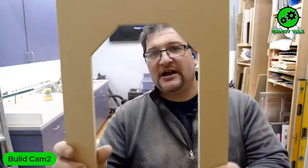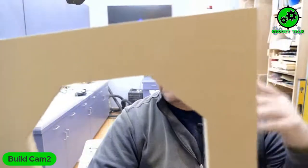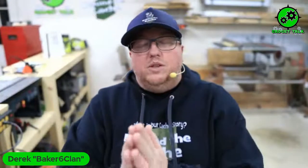So anyways, you can see the corners. They turned out pretty good. They're pretty cornered. You know, there's a roundness to them. No matter what you do, unless you're cutting on a laser, you're going to have some kind of roundness. You can go with a 1/8-inch bit. Remember, the smaller the bit, the slower you have to go, because the more pressure you put on it, you're heating that bit up and it could break. And you don't want a bit at 4,000 RPMs coming off and hitting you in the face or anywhere in the body. So, take your time. Don't force it. You'll know by the feel of the router bit when you're feeding it if it's going smooth. And remember, the router goes in one direction as you're going along. If you go the opposite direction, it's going to start skipping. So you always want to do that.